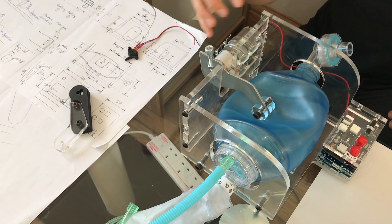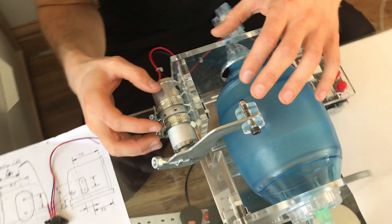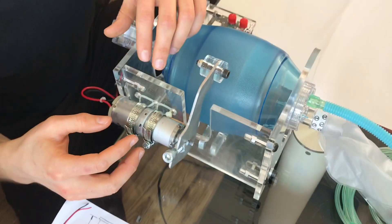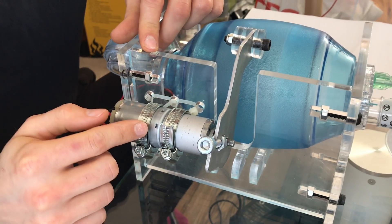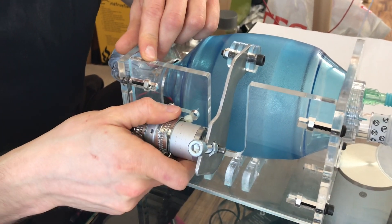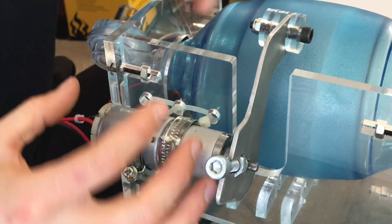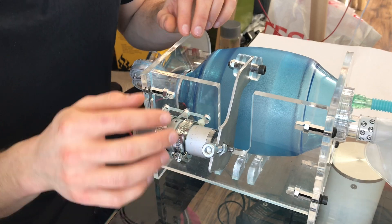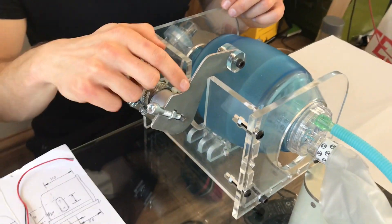The way the motor is held in place looks kind of crude, but it's really universal. It's attached with a few cable ties through holes and two jubilee clips, so it's a really strong way of making a universal motor mount that will work with any shape and size of motor within reason.